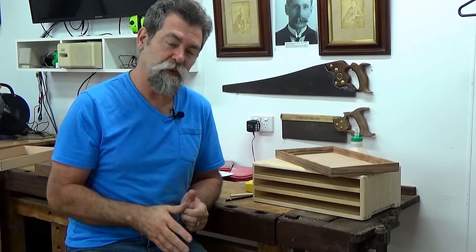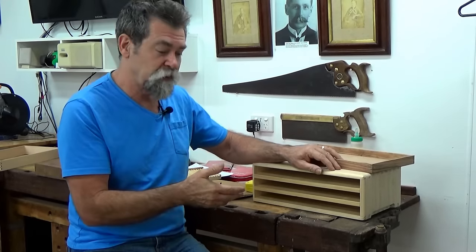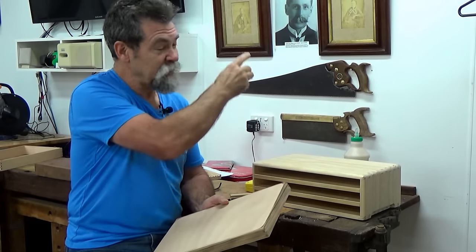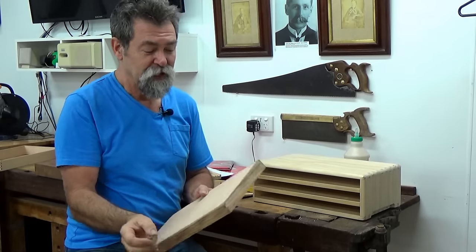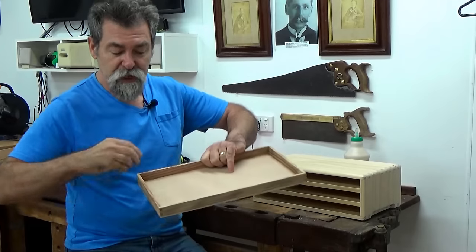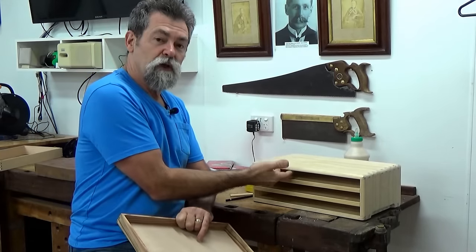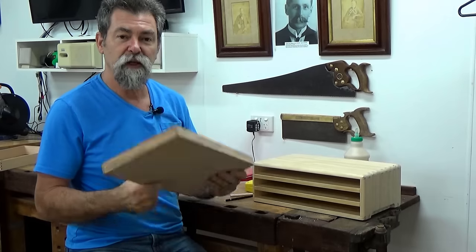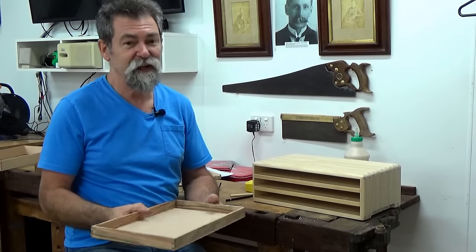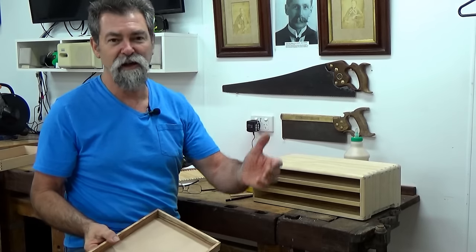All finished — now we need to make sure the drawers have a beautiful slip. The drawers are probably sliding in there quite well, but you might find they chatter a little. We're going to rub all over with a candle — just a little bit of candle wax all over the varnished sides and top and anywhere that comes into contact with the outside box at the friction points. You'll be amazed at the difference. Push in and out a couple of times and it glides absolutely beautifully.